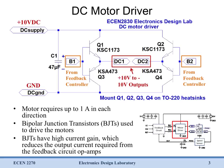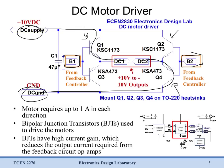Internally our motor driver is going to look something like this — it's a BJT based motor driver. You can see we have four BJTs. We have our two control signals from our feedback controller, B1 and B2, and these are low current control signals — they aren't driving a lot of power. They come from a simple feedback circuit, which in our case is eventually going to be an Arduino microcontroller. What we would like is for all the voltage and power driving our motor to come from our DC supplies, with current flow from those supplies. We'll hook the motor up in the center and be able to supply it with anywhere from 10 volts to minus 10 volts.